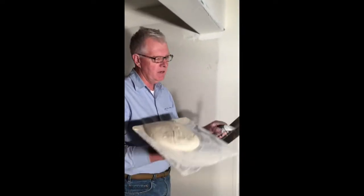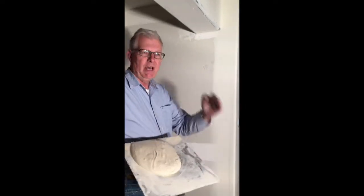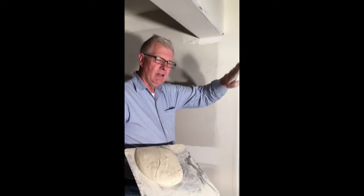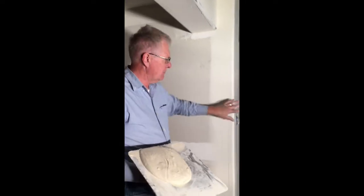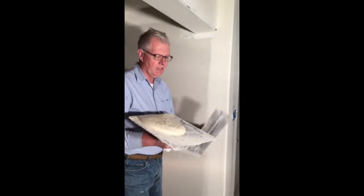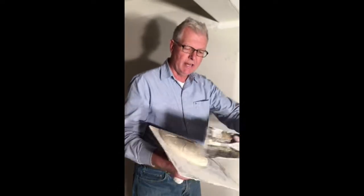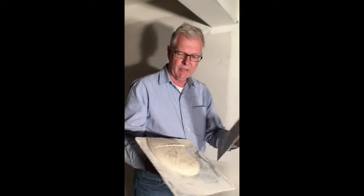I find that's a lot better because I have a stiffening back on there, and with the knife, if you push hard enough, you're gonna have a concave type of pattern that goes across here. Whereas with this trowel, you do not. What you do with this trowel is you can gauge it. And once again, that's the nice thing about a hawk. It's flat, so you can get access to wherever you want to work this trowel.